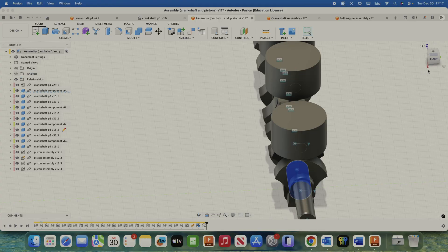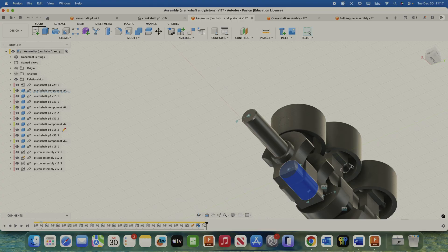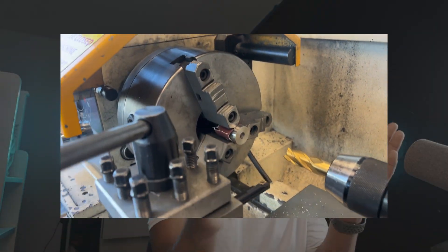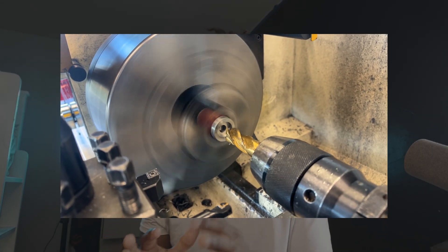Whilst waiting to move to the milling section, I've been working on the piston heads. In theory they should have been easy — just cylinders with a bored-out centre and a hole drilled in them. But on our lathe, we've only got a boring bar big enough for 16mm, and I need to get it to 21mm. So we put the end mill in the mill, it's now at 16mm, and I need to press it down to 20mm then bore it 1mm to get to the right size. But I've tried two different end mills, researched the cutting speeds for stainless steel, and I can't get it to cut for some reason. I got all of them down to 16mm fine, but I just can't get to 21mm. I've done some more research and need to implement it when I go back to school.